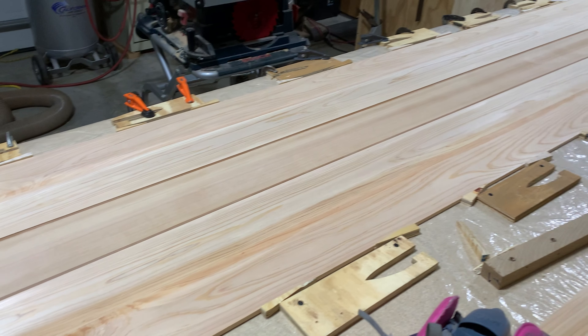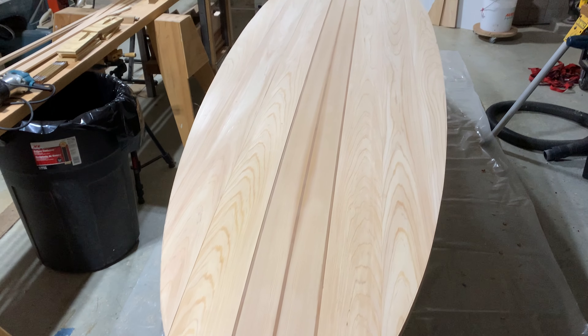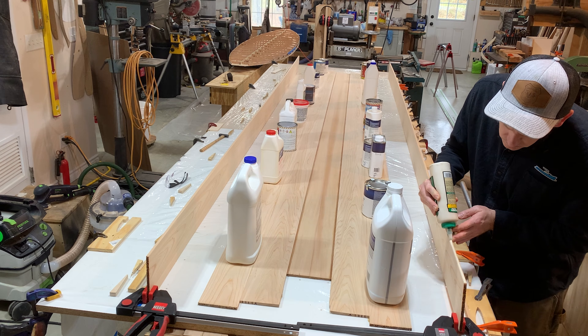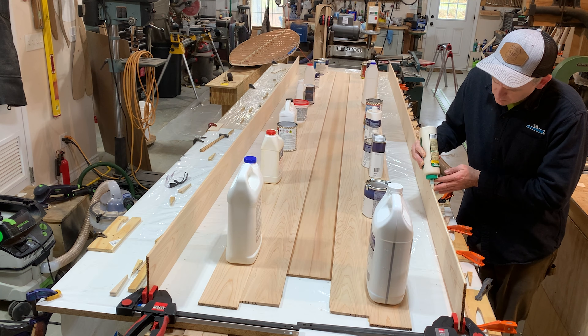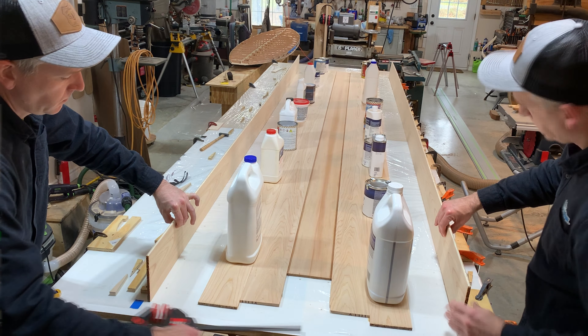I did the exact same thing for the top. Now the top has a camber to it, so I was a little concerned about bending the top sheet around this curved deck, but it ended up being easy. Same thing — block screwed to the bench, wedges clamping the blocks, and then when you get wide like this you want to put some weight on top, or figure out a way to hold this thing down, because it'll kind of buckle up when you run your wedges. You don't want it to be a bow shape.